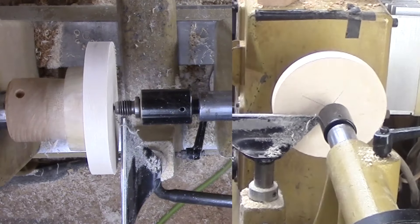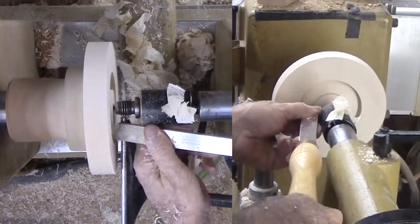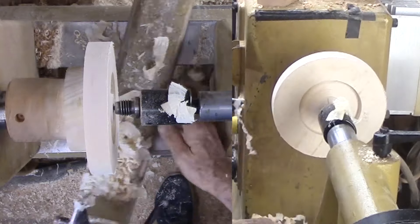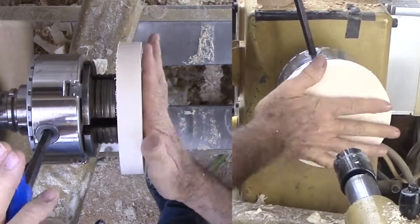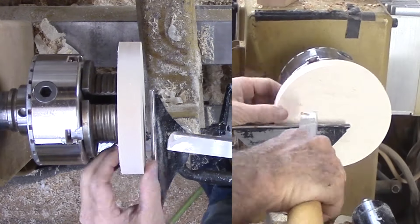The next part I could have turned without tape, but I like the security it gives while I cut a large mortise with a box scraper. Just to give it a bit more grab, I form a slight dovetail with the skew. Now reverse the tray to present the bottom side, while the mortise will hold it securely while I tool the bottom side.